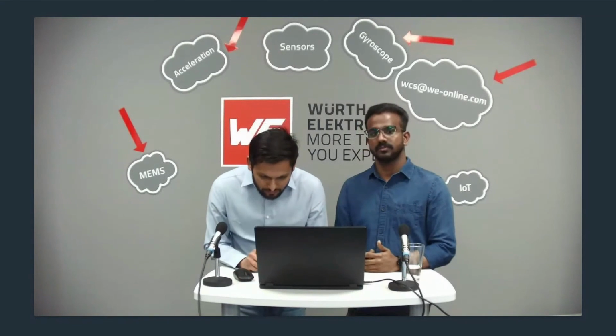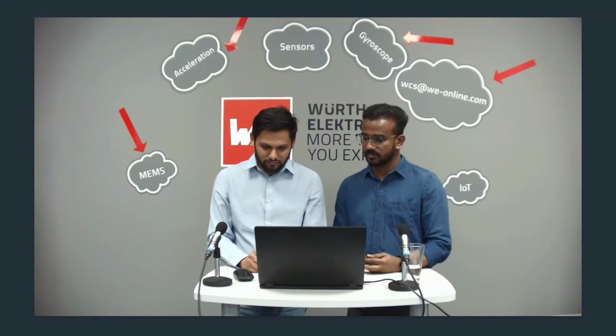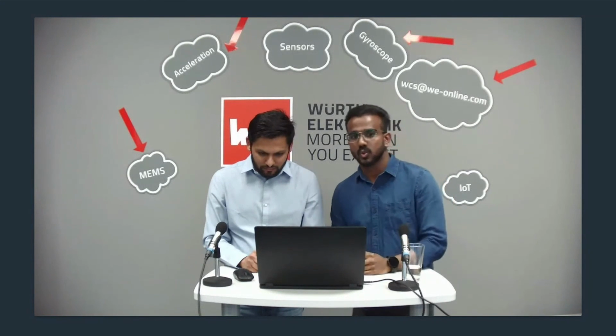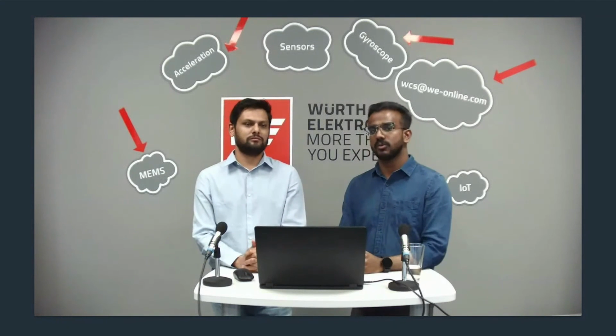Will there be an integrated sensor system that includes all the orientation and rotation calculations on the sensor, to unload this algorithmic work from the microcontroller? Do I understand that correctly? What I understood is, will there be a system where the sensor fusion happens inside the sensor? Usually these orientation and rotation calculations are done using complex algorithms like Kalman filters and Madgwick filters. They usually combine gyroscope data and accelerometer data together using some complex algorithms.